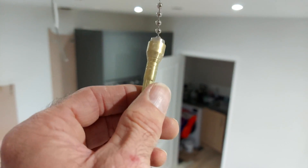Good morning, welcome back everybody — it's day three now of this kitchen job. It's not really a full kitchen rewire, just a little kitchen job. We've got the downlights in from yesterday, the spur done for the plinth lights, and we've sorted out the dangerous cooker circuit and hob circuit which was fitted by the kitchen fitter. Today we've just got a couple of pendant lights to fit, a new socket for a fridge freezer, then we need to make good all the holes in the ceiling and do our final testing.